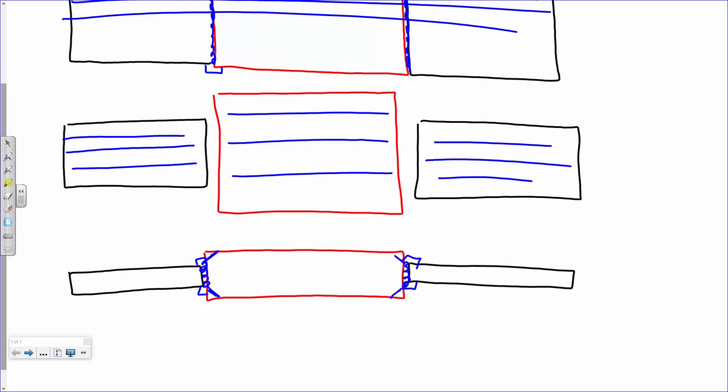I propose to you that if all you do is change the thickness, you can do one set of welds, one set of cuts, and your flanges are done. So never, ever change the flange width. Change the flange thickness. Makes sense. I'm saying for all your girders, if you're wanting to optimize your girder by changing some sizes, change them by changing the thickness, not the width.